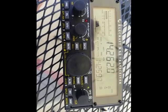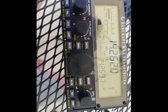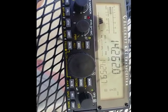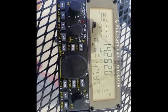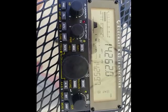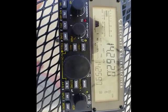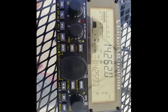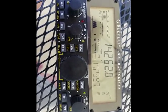Notice that the noise floor on the dipole is much higher than that of the loop, so you also have to look at it in relative terms — not only in terms of the peak readings of the S-meter. So it really is not the difference of two S-units or even three S-units. You have to look at it compared to the noise floor. I will try to connect the loop again in a moment.